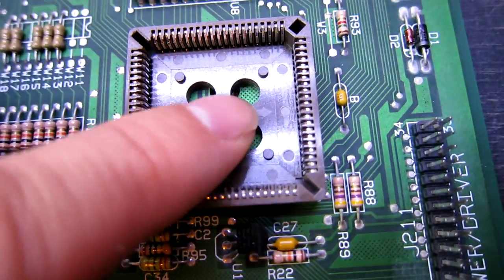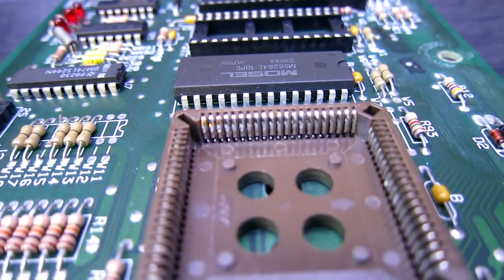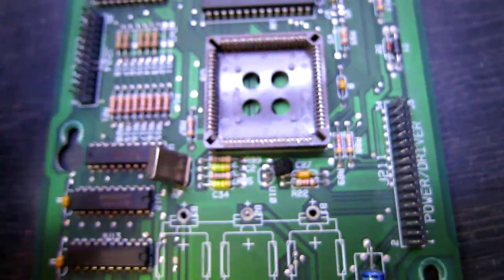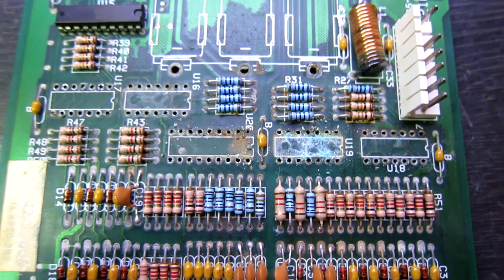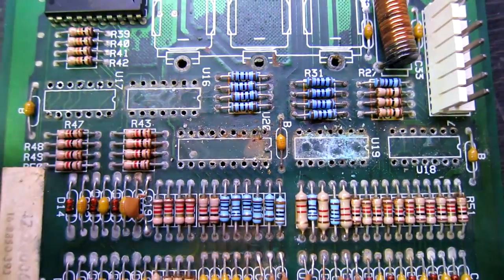These might have survived. Looks like we've also got a bit of corrosion - I can see it on the pins. It's a horrible job but we're going to replace this socket. It's not a particularly complicated job but it's got so many pins so it takes a while to do. We'll do that first and then we'll see what's up with the board.